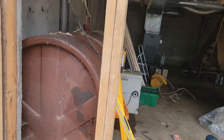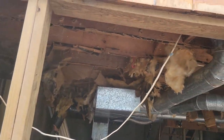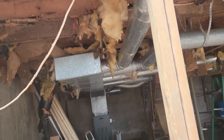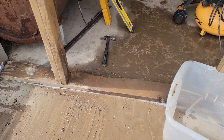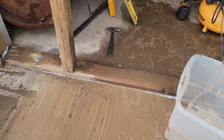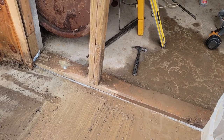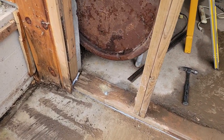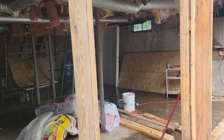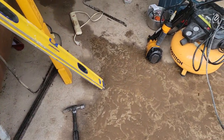I doubled up and used some treated wood from under the porch. I framed out the door opening where I want it — it's going to clear that pipe nicely. I did the sill under the door, so that extra inch and a half is going to help. Then we're going to do the flashing, the caulk — the whole deal — to get this as waterproof as possible. We're winding down at the end of the day, but that freak storm really messed us up.